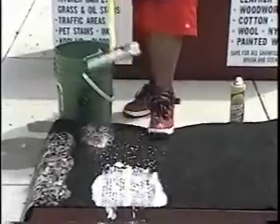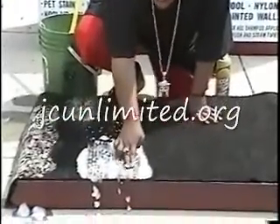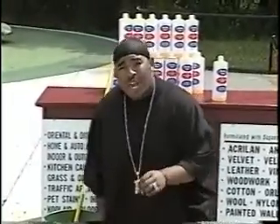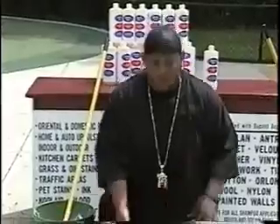Here's what happens. Technically, all you're looking at is a dry cleaning process made by DuPont, which uses an enzyme. What the enzyme does is it breaks up your stain — it literally separates it from the carpet. Now it's trapped and locked inside the foam. That's what we call soil suspension. Just give it about two and a half hours and it brings everything up to a powder. Now you just vacuum that dirty powder out.